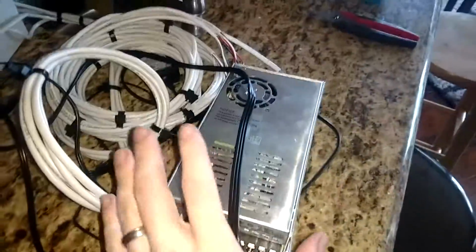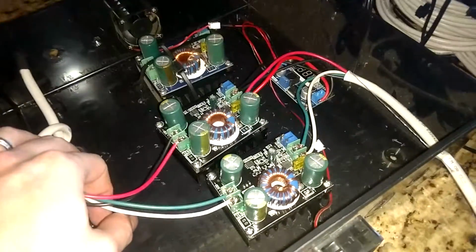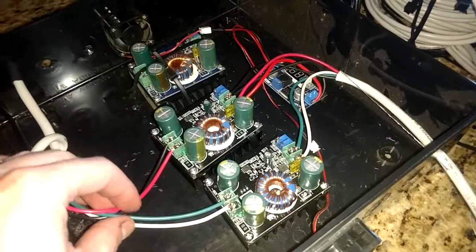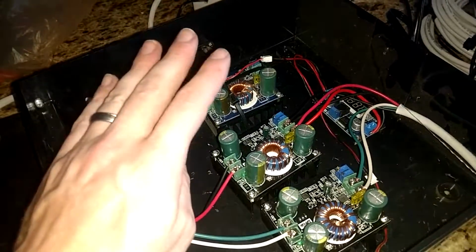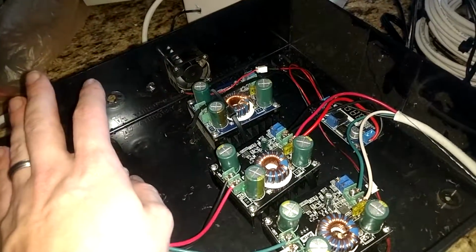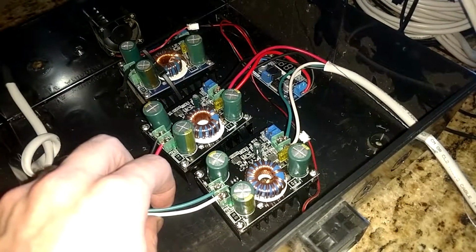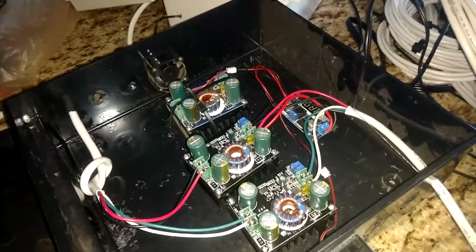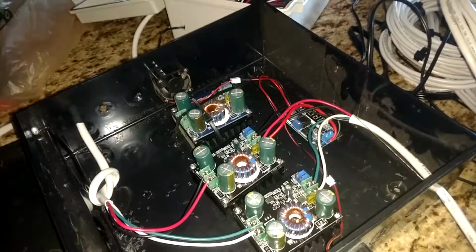Sitting in between the supply, so again, source, this plugs into a 110 outlet AC. It will go into this box here. These are the buck-boost constant current, constant voltage supplies. There are 3 of them. I'm only using 2 of them right now. So again, red, it's not boosting at all, it's just controlling current. And then the blue one, for the blue diode, it's boosting to about 30, taking 24 volts input, outputting about 30 volts. The blue diodes in my test ran at about 75 watts, and I'm okay with that. They're 100 watt rated, but I'm underpowering them and that's going to be just fine.